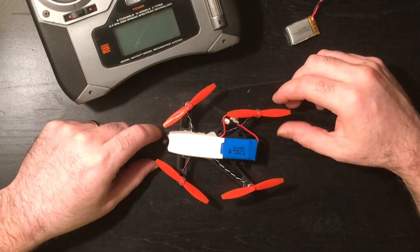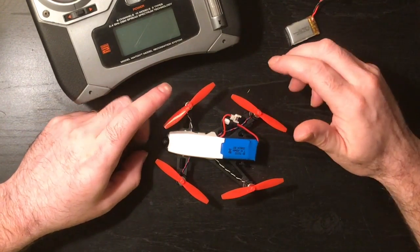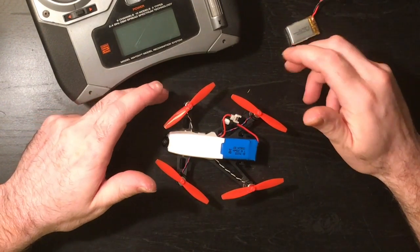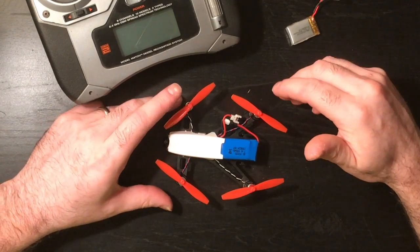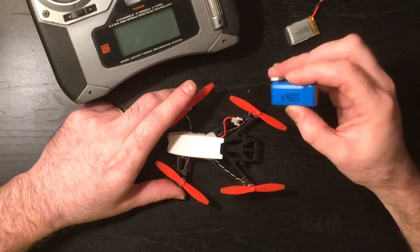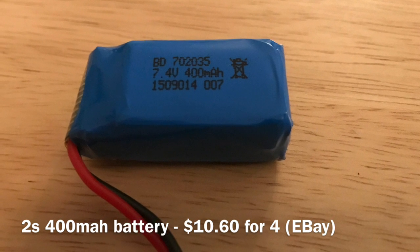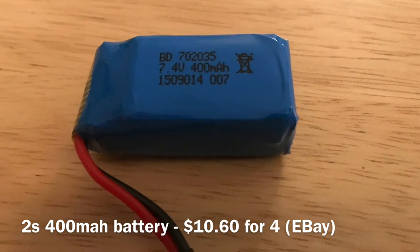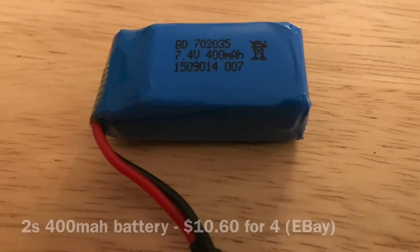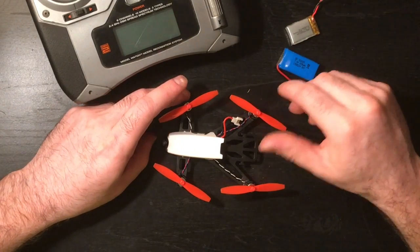It was just too cold and I didn't even have a full charge on the battery — I just went out and tried it. I did want to walk you guys through the components I used, because there aren't a lot of two-cell builds out there. I paid about two bucks for these 7.4V 400mAh batteries. I don't know what the flight time is yet, but for this size quadcopter I don't think I'd want to go any heavier.